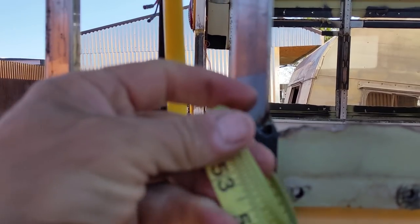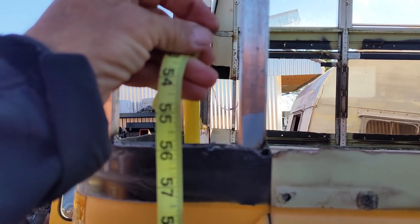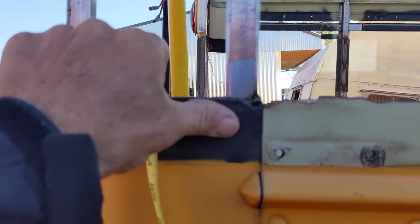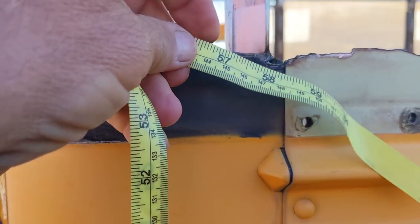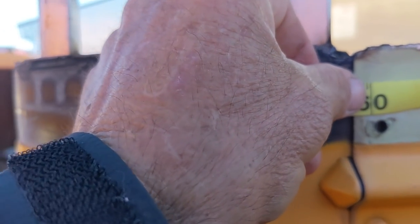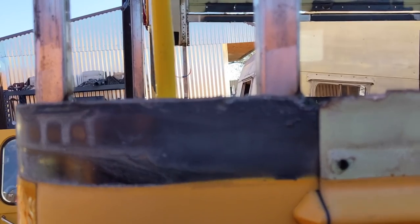And my favorite way of measuring these, which I can't do one-handed, is with a little tape measure I got from Joann's Fabrics. Regular metal tape measure just doesn't get around the corners as accurately around these curves. So I keep one of these, which I have to turn around and start at zero, but it just works really well. You can hold it here and then measure around very accurately, and we're at 35 inches for that.